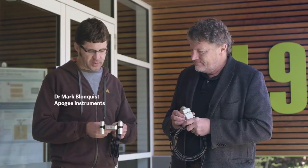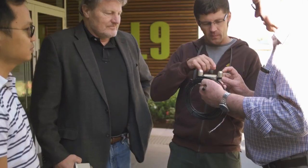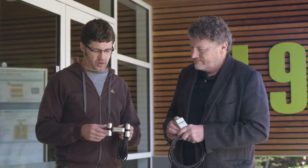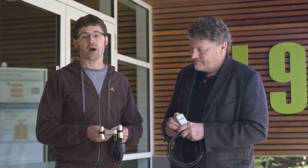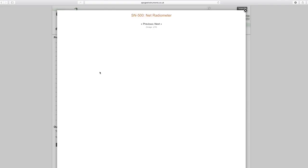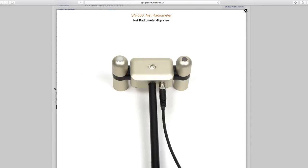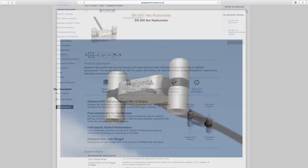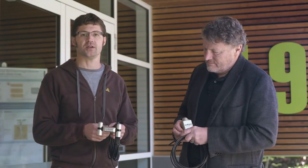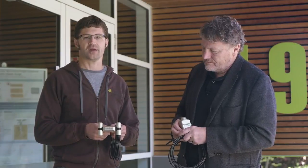I'm holding a net radiometer. Like the spectroradiometer, we've been developing this one for quite some time. The design goals were to build a small, compact, lightweight instrument to facilitate mounting, while also making a four-component instrument that was lower cost but still performed accurately and compared favorably to the four-component instruments already on the market. All of the signals come into a central analog-to-digital converter and are output as SDI-12, so it doesn't require a number of data logger channels. Also, each individual sensor has a heater to keep dew and frost off the detectors and facilitate accurate measurements in all conditions.